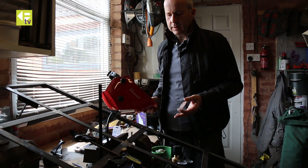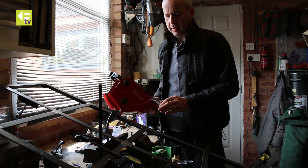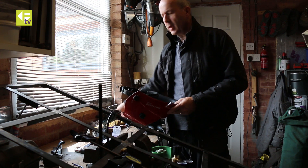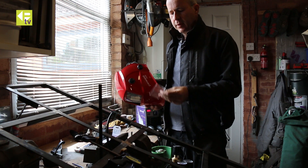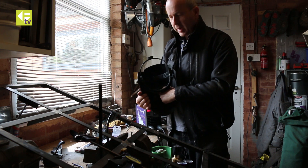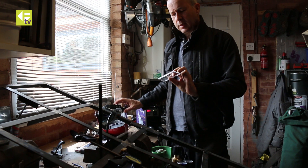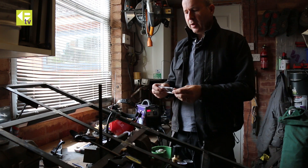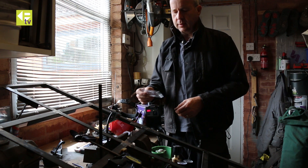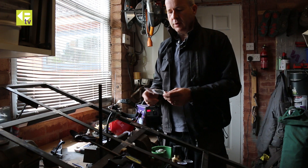Great little tip: if, like me, you have to wear reading glasses, you may struggle when you're welding — especially TIG welding — when you need to be focused closely on what's going on. You may find the focal length of your glasses doesn't really work with a welding helmet. A great little addition is one of these diopter lenses. Better quality welding helmets have little brackets on the inside that allow you to slide this diopter lens in, and they come in different magnifications. This one is x2, which for me I find perfect — I can weld without having my spectacles on and have a really clear view of the weld area. Really useful device, and you don't have the problem with your glasses slipping down your nose.